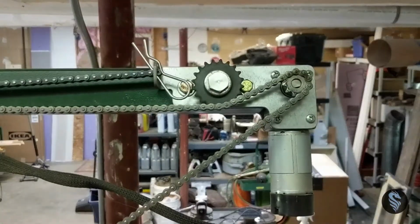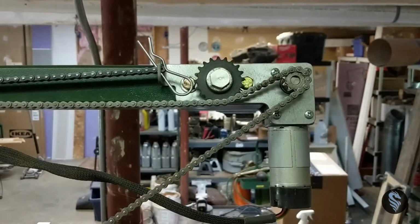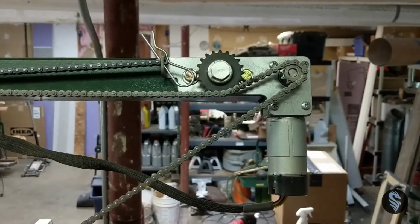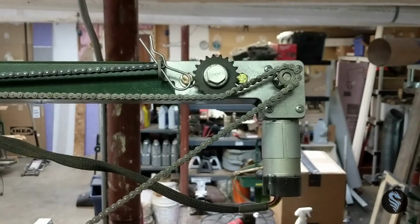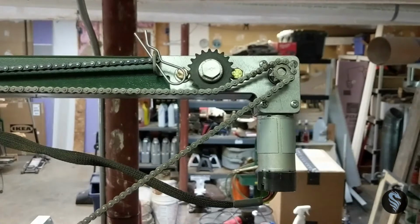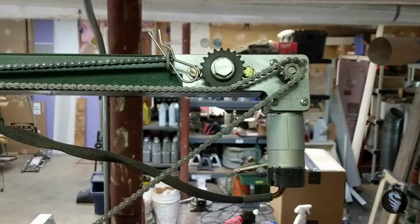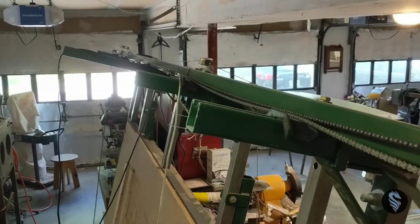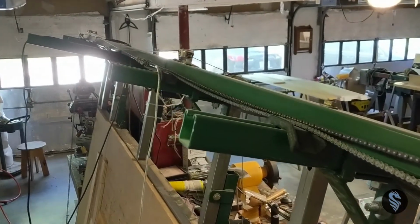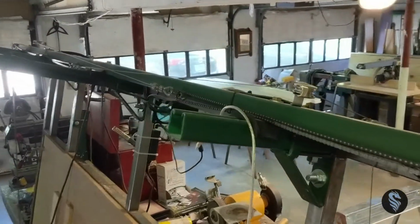So while that's cutting, let's take a moment and talk about the chain drive system that I've devised. As you can see from our previous illustrations, I have my XY motor configuration here with the idler sprocket set in the middle, and I'm underslinging the outfeed of the chain, and I'm also securing the slack side there on the bracket itself. The slack sides of the chain feed back out over the top beam itself and ride in these little 3D printed carriers to keep anything from getting hung up in the unistrut channels themselves.